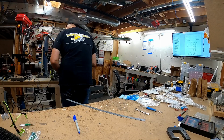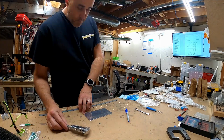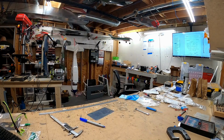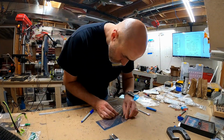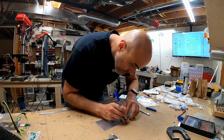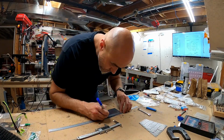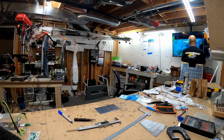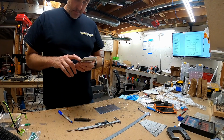Most of the time you can look outside and see where you're at. But maybe you're in an unfamiliar area, or in instrument conditions and you can't see anything because you're in a cloud. Great. Probably a good idea to have GPS antennas. That's what this episode is. There will be two GPS antennas on the tail cone of this airplane, and in order to mount them, you need to make up some doublers. So that's what we're going to do. Make up some doublers.